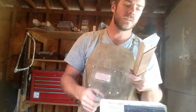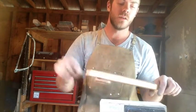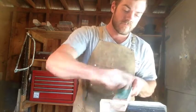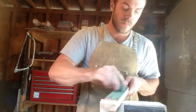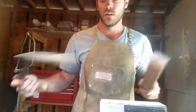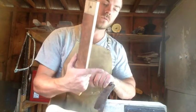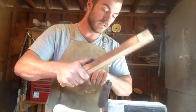This is a strop. It's just a strip of leather. Sometimes it's on a piece of wood like this. Sometimes it's just loose, so you can whip your knife over it. And this is honing compound. It's just a stick of very fine abrasive. Rub a bunch on your leather strop. And then the same as with the sharpening, do the backside first. And you go not into the blade as you would with a stone, you come away from it, kind of go with the blade.